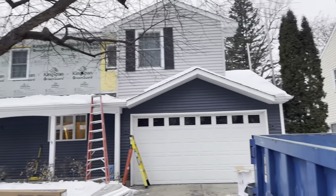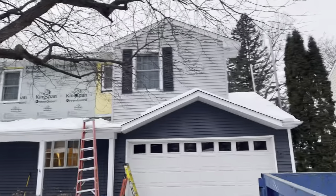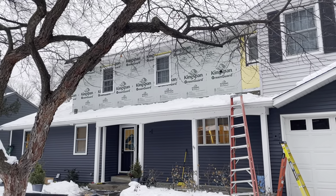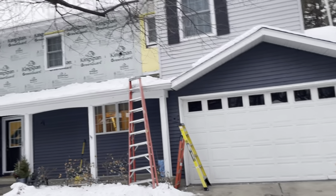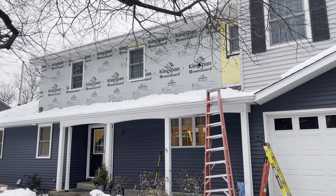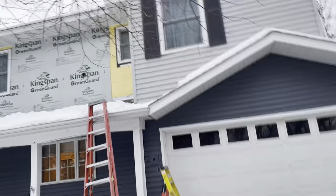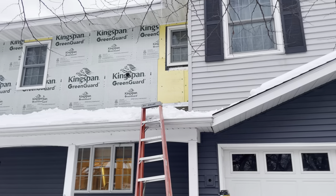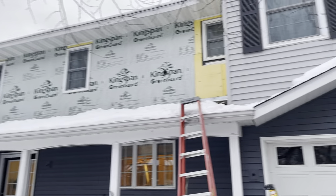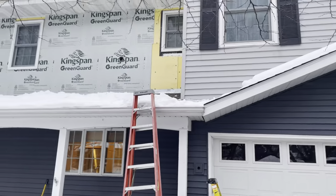You can see the new dark blue siding going on and the old siding is still up in a couple areas. On this job you can see all that green underlayment - it's called fan fold. It comes in accordion-like sheets, you nail it on to the home and tape all the seams. This house also has some pre-existing rigid foam insulation over the sheathing, so that yellow rigid insulation stayed in place - we don't replace that during the re-side.